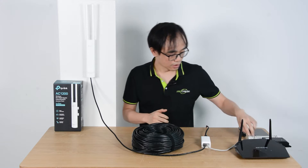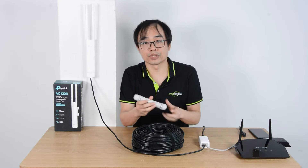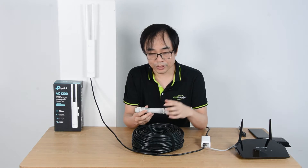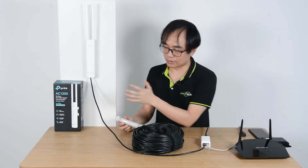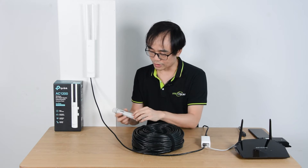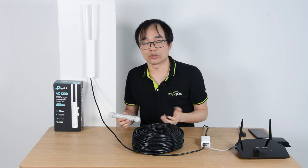In this case, you still need a PoE extender. The PoE extender will repeat the PoE signal for another 100 meters. If you chain one unit, you can have a total of 200 meters.